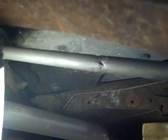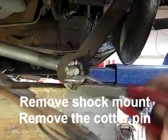One of the things we notice on taking this apart — this car had been into one of the Corvette shops in the Chicagoland area and the owner had some work done on it. I don't know who did it or why, but it's something dangerous. Somebody had actually cut this strut rod and welded it back together and put it back on the car. This strut rod will actually be replaced before it leaves our shop.